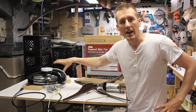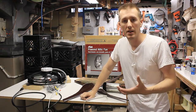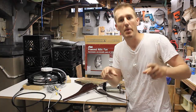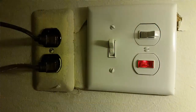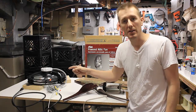This attic fan runs at the hottest time of the day when your attic gets hot. A whole house fan you run at night when it's cold outside and draw in all that cold air. One big change I'm going to make is a bypass switch that bypasses the thermostat. I'll put it in a bedroom with a pilot switch with a light, so I can run it at night. Most of the time it will run automatically during the day.